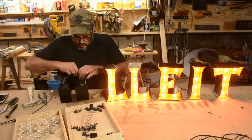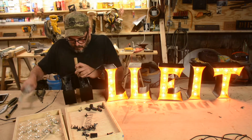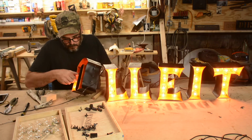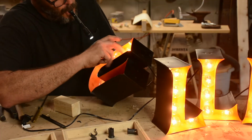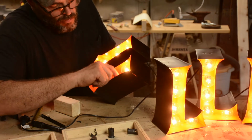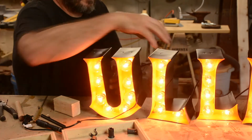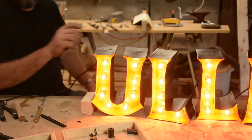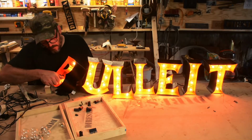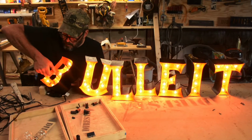And you'll notice I have that block of wood on the other side of the socket so that I can hammer down the clip. Because that clip goes in, but by banging it, the fangs puncture into the wire, which creates the electrical connection. And here I am, just testing all the bulbs. And I leave the bulbs in the whole time because I want to make sure that if I disconnect any one of them by accident or if it gets jolted, I want to know which one it is. So the rest of the time I work on the sign, the light bulbs stay on.